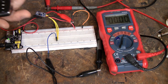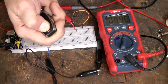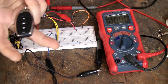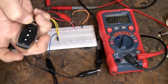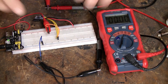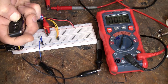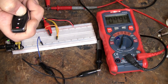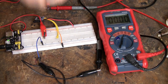It's a pretty sophisticated little circuit too, because it's not just holding ground. Hooked up to one side, you can see there's nothing. If I push one side, that side goes to ground. If I push the other side, it does nothing. If I don't push any button, it does nothing. On the other side, the top one does nothing, but the bottom one makes it go to ground. Testing positive — there is no positive at rest. When I push the top button that one goes to positive. Bottom button gives nothing. Other channel: top button does nothing, bottom button makes it go high. So both outputs are floating when not pushed, and they go positive or negative only when a button is pressed.